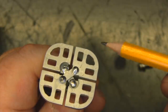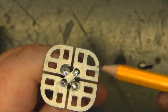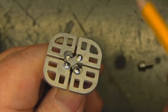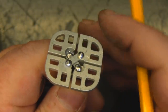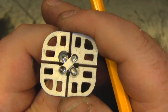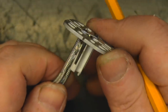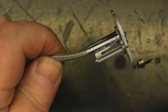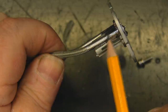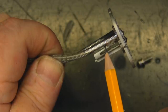The VSWR of these types of antennas is pretty high - around 1.8. Probably to get the VSWR below 2 that's why we've got these cutouts here, same with the other one. The other one looks more like a bowtie antenna but it's not. I'm wondering if you could get away with just drilling those holes to make it easier if you wanted to build these. It's a very interesting, very simple design. Not a lot of gain on its own - all the gain comes from the parabolic dish you intend to use this with.